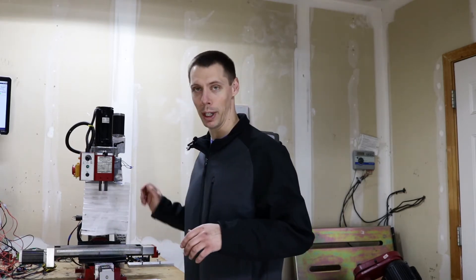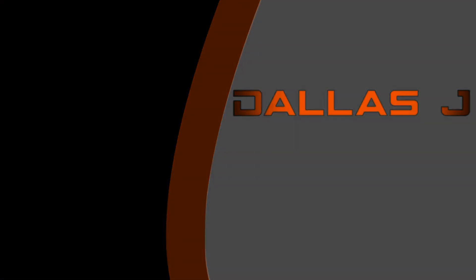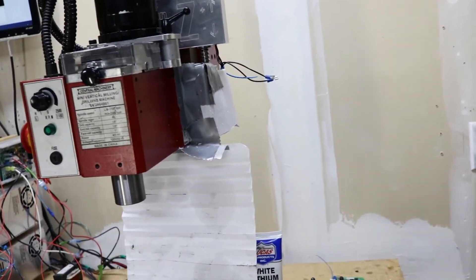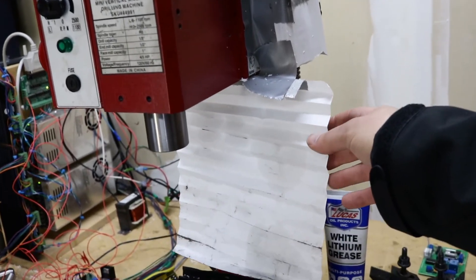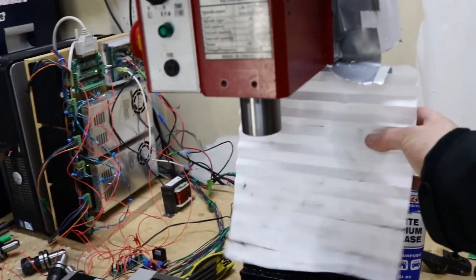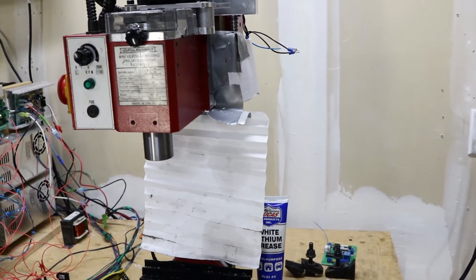To get to the root cause of that would be to cover up these ball screws. You can see I've done some makeshift bellows here — that white part is actually just printer paper, and it held up for the duration of the job. It covered most of that ball screw behind it. Every now and then some pieces would get on there, or if I'd be vacuuming and shake it, they might fall onto the ball screw and I'd have to clean it off. But for the most part it worked okay.